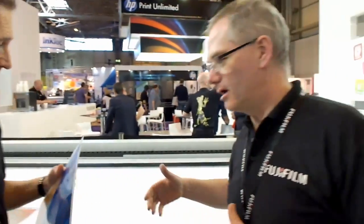When a customer comes to us looking at a machine like this, what majority of work are we looking for them to be doing to make it worthwhile? Typically, if they're printing onto rigid material such as Foamex, Correx, or display board for display POP applications, there's no great advantage in having a hybrid if the majority of work is straight onto rigid material — purely because of the registration, the double-sided work, and the fact that the vacuum table holds the substrate completely flat.